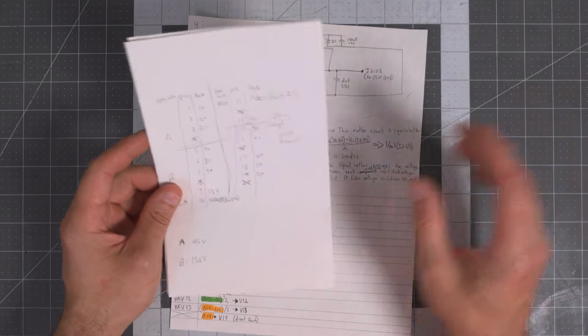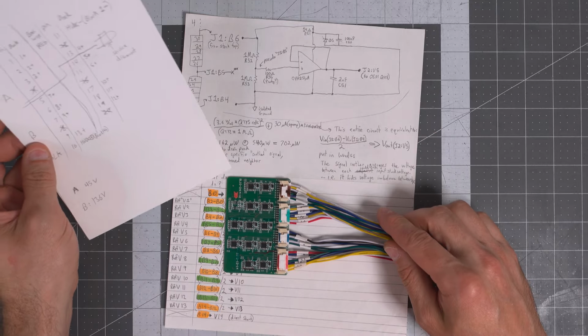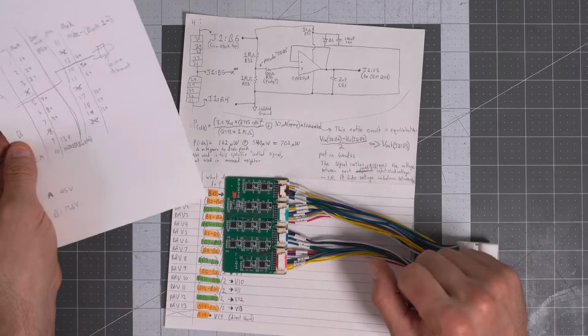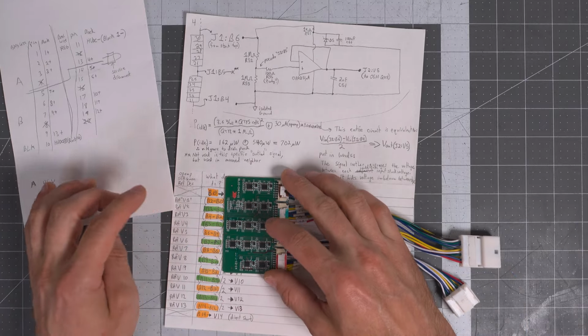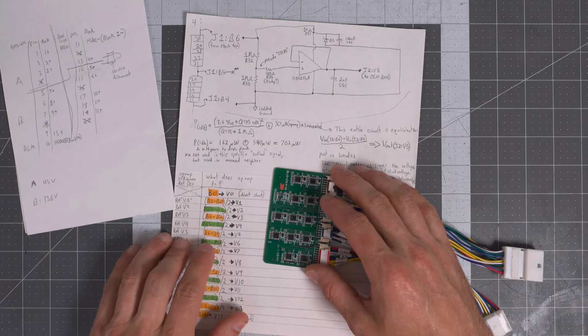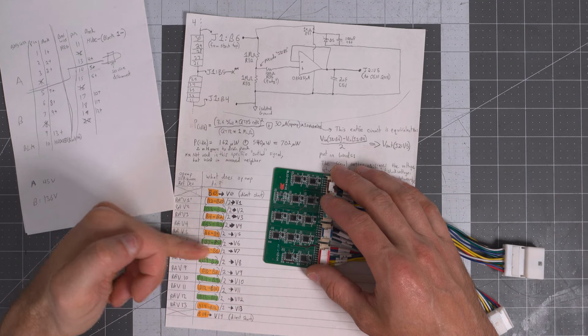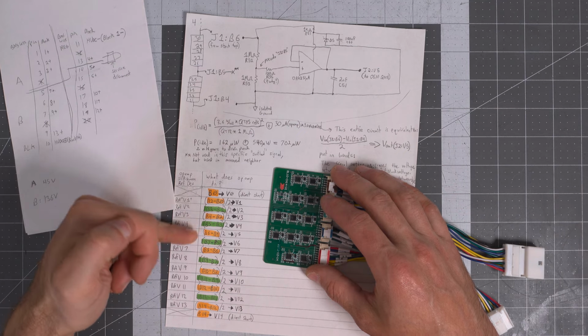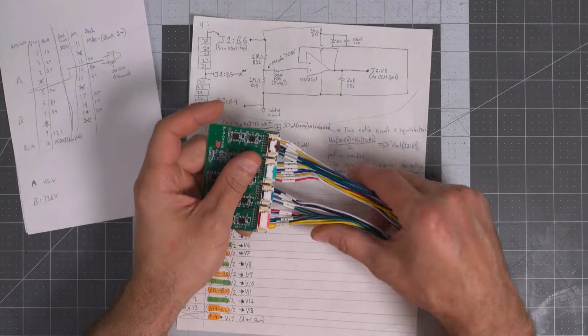So, yikes. A consequence of that as well is if you try to turn the key on with the disconnect removed, say you're troubleshooting and you forget to plug it in, you're going to break this in 2 spots, because you're going to get the full pack voltage across the 4 and 5 on the Gen 3. So somewhere about here, you're going to blow up V4 and V5. And yeah, anyway, there's another issue here.